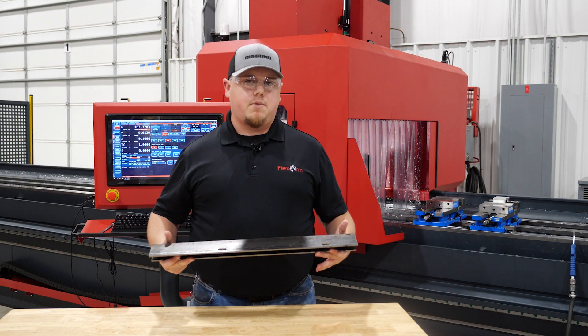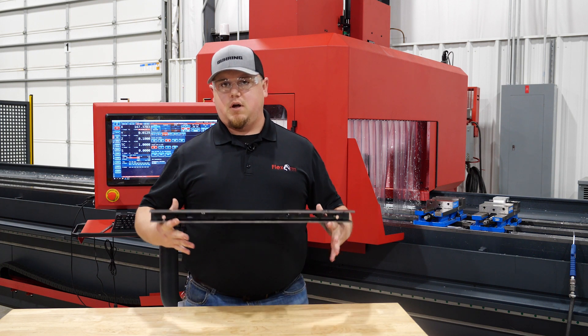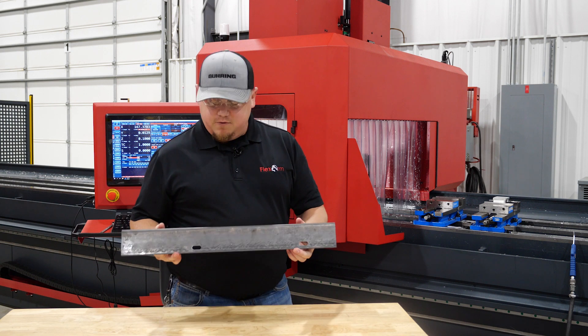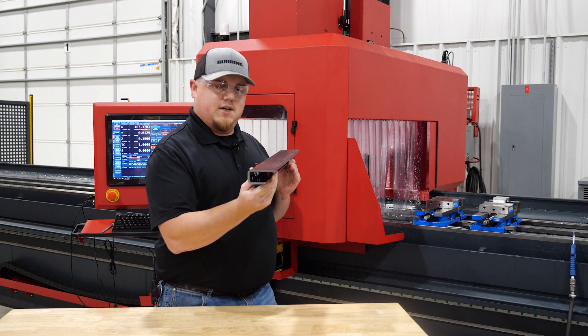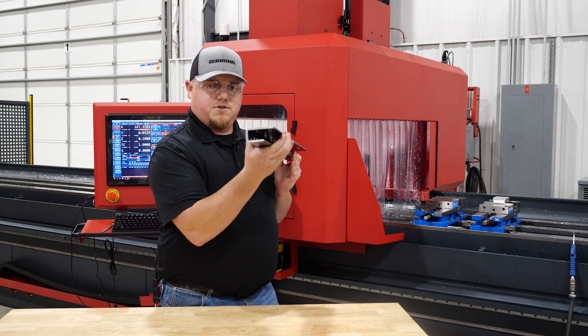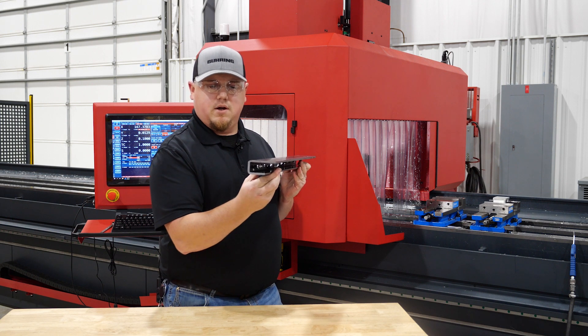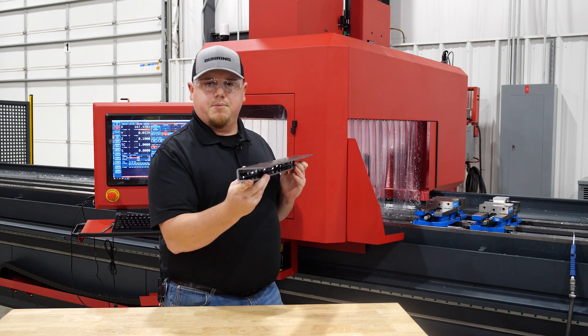Because it is just a demo, I'm not sure if this is the actual length of the part or if it's a longer part that we'd have to fit on the machine. So the first operation — we have two slots here on the longer side of the J. We had it clamped into the machine like this, clamped also on the top of the J, but we also wanted to put a little bit of clamping force down to the bottom so we didn't get any pop-up action coming in from the back side.